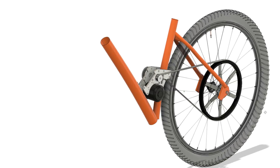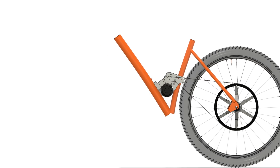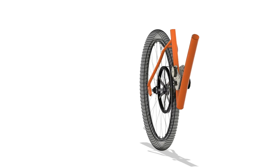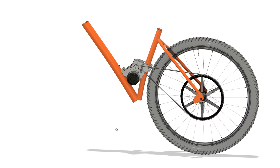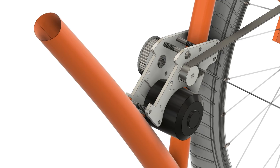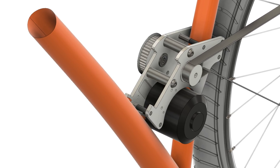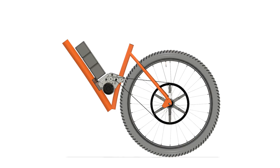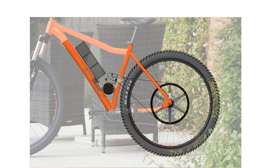This should result in a top speed of about 33mph compared to the previous 38mph of the version 3 e-bike, but it will have a lot more torque for hill climbs and wheelies. I then had to figure out all the holes for the bolts, plate spacers, wires, and the VESC speed controller, as well as designing the 3D printable clamp blocks for the vertical seat post and the bracket for the bottle mounting holes, whilst also making sure the lithium ion battery packs would still fit inside the frame.